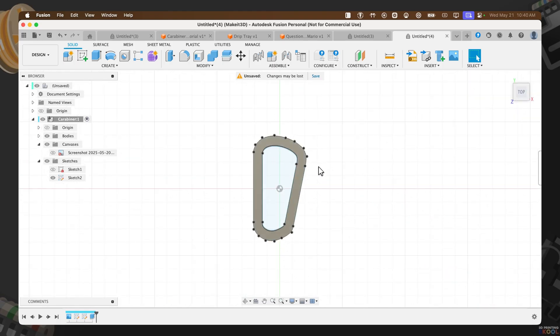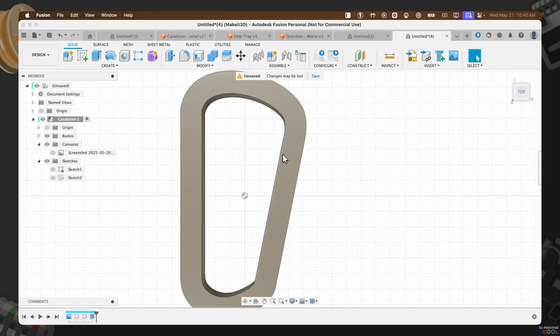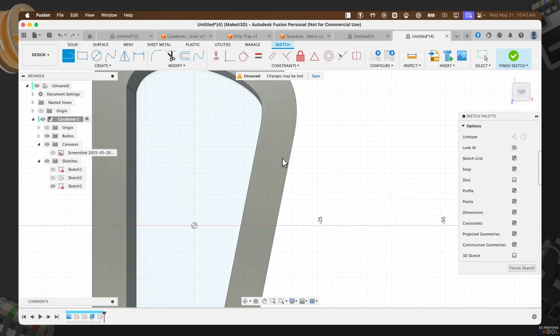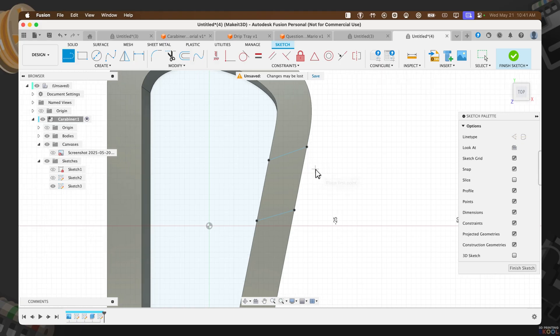With that complete, we have the first stage of our design. Turn off Sketch 2 as we'll no longer need it. The next thing is to create the cutout — specifically the snap fit. Create a new sketch, then select the face. We want to create two lines on the straight line going down, not towards the top where the spline sits. Find a spot that makes sense — just below where it snaps on — then create a line going left and down. Create one more going down. This area is where we'll work to create the snap fit.